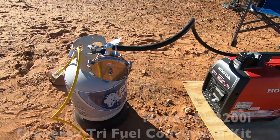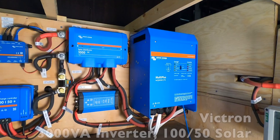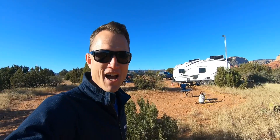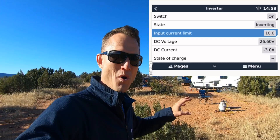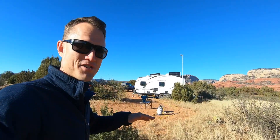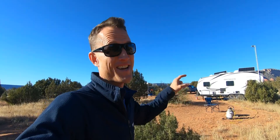This is our campsite and we're doing some power testing. My plan is to see how much load I can put on the generator. I have a Victron inverter — it's 24-volt solar with a couple of panels tilted. Victron has a hybrid assist mode currently set to 10 amps, so it's going to register about 1,000 watts. We'll increase slowly until we push the limits. Keep in mind we're at 4,000 to 5,000 feet elevation, so as you go up in elevation generators lose efficiency. I'm going to push it — here we go.